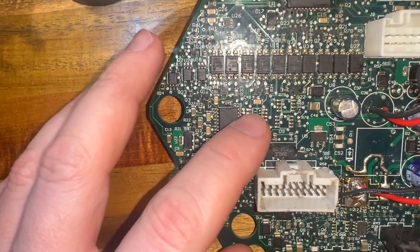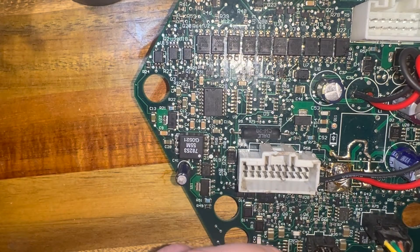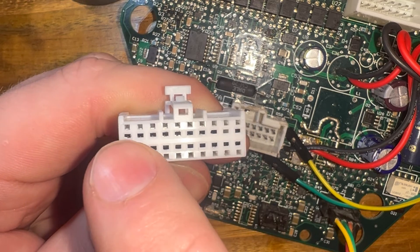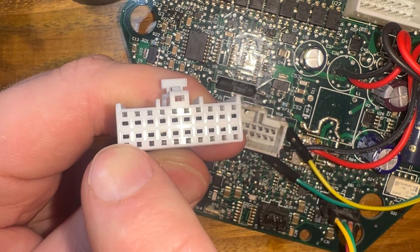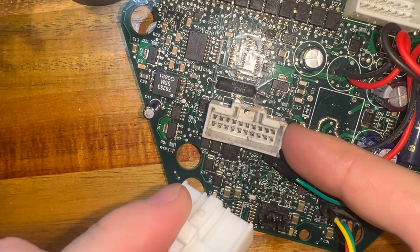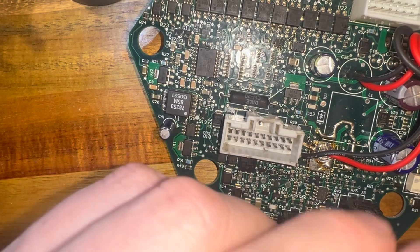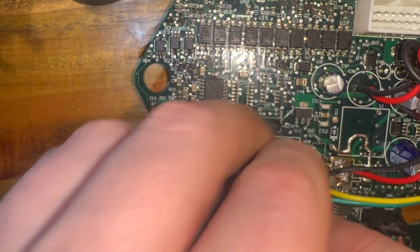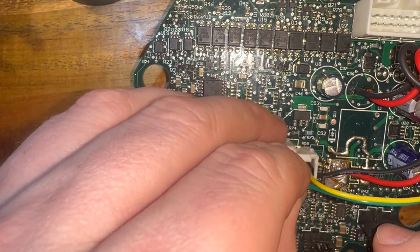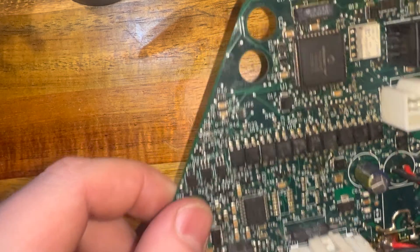But I'm hoping this helps somebody out there. Looking at the connector, if you're looking at the schematic, this is pin one — it goes through pin 10, and then pin 11 through 20, left to right just like a book. Pin one is positive and pin 14 right here is negative. So 72 volts on pin one — using these little DuPont connectors, they fit on here pretty well. You might get a little pop on pin 14. And we heard a relay click — I don't know if you heard that on camera, but one of the relays clicked, which is a good sign.